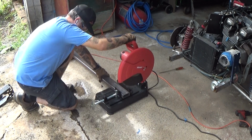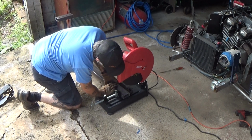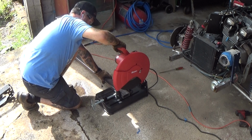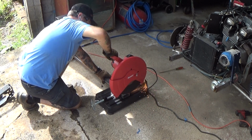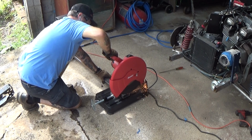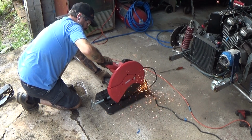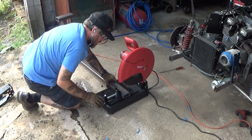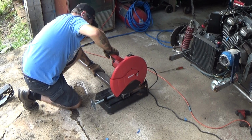At this point, I was attempting to use my drop saw to get a square cut on the same material I had used before to make the previous bumper support. I was going to replicate the design, but execute much better, or at least, that was my intention. I started running into issues with this drop saw where it wanted to walk, and just after even, say, 3 minutes of holding it in one place waiting for it to cut through, it would just not cut through.